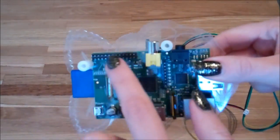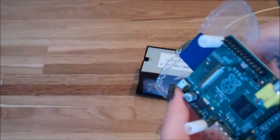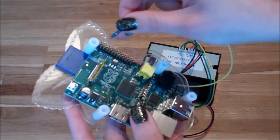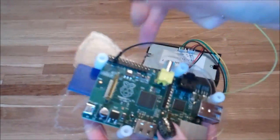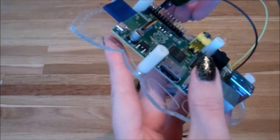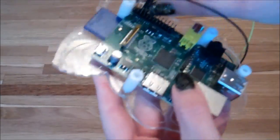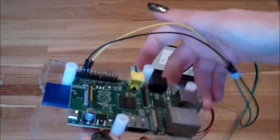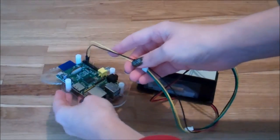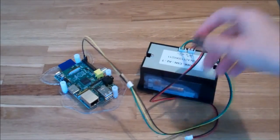Once you know that your printer is working, you can plug it into your Raspberry Pi. Here's my Raspberry Pi, and here are the GPIO pins we're going to plug it into. We're going to take the yellow and black cables I put in earlier and plug them into the board. It's important to note you can't just plug these in anywhere — you need to connect the output of the Raspberry Pi, the serial TX, to the input of the printer serial RX, and you also need to plug the ground in. There are lots of labelled diagrams for the GPIO pins on the Raspberry Pi on the internet, and I will include one in my blog post when I type up this tutorial.